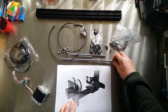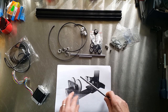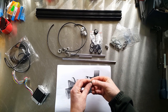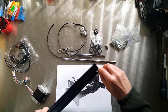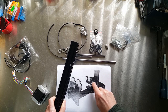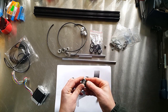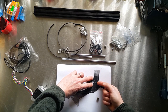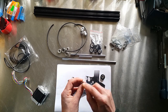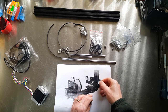We've got a series of rods here — this is silver steel — and we're going to make the drive pins out of silver steel. We'll have to thread these so we can get our connections onto those. We've also got a couple of pieces that go into the V-slot and can be used as a clamp system, so when we move this end in and out we can clamp it down using thumb screws. We've got two V-wheels on one side of the beam and one on the other. I've got some cam nuts with the center hole off-center — spinning those gives us adjustment to pull that wheel in closer and get a tight fit onto the beam.